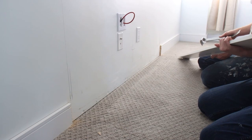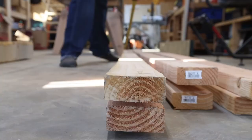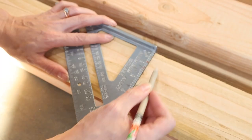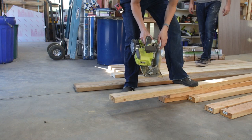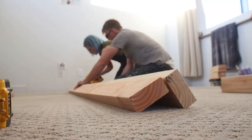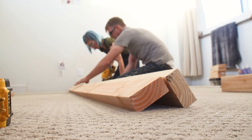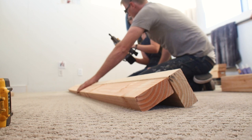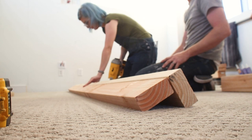Next we began to cut our lumber down to size. Don't worry about writing down all the dimensions as you follow along — I've made the full building plans available with a link in the description box below. You could use a miter saw to cut your lumber down to length if you'd like, but it's really not necessary. A speed square and a circular saw do a great job. We began by assembling the outside corners of the fireplace, aligning two studs perpendicularly corner to corner in what's called a California corner. We're using a battery-powered framing nailer to connect our wood together, but it's not required — you could use hand-drive nails or an even better option would be to join all your lumber together using screws.